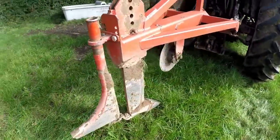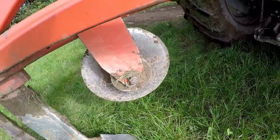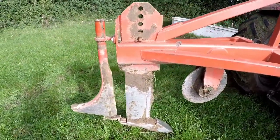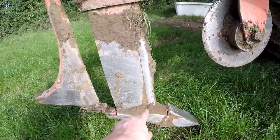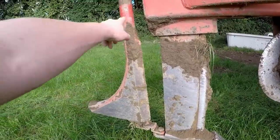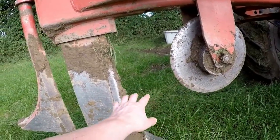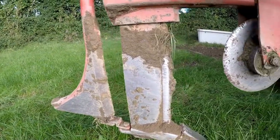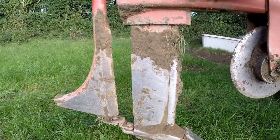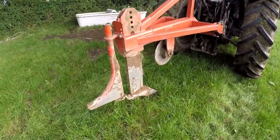This is the mole plough. As you can see, it's got a disc here for cutting the ground so you're not damaging the surface too much. Then the mole plough carves the path and you have the shoe which the pipe goes through. You can see the depth of it — it's probably going down maybe a foot and a half, maybe two foot. It's not that deep, but it's deep enough for us. We don't do any ploughing around here, so it's well below the topsoil.